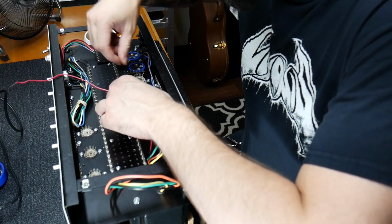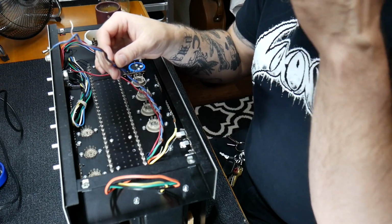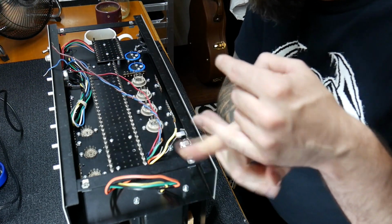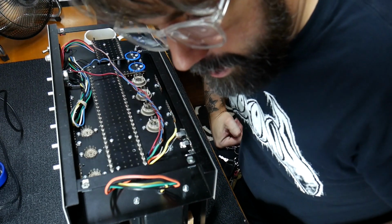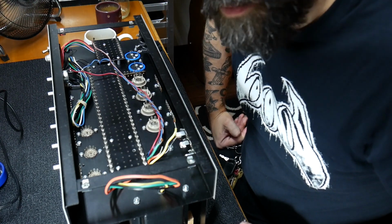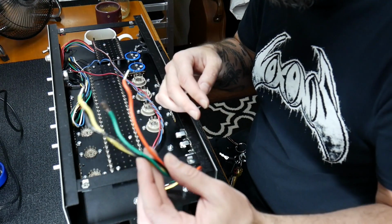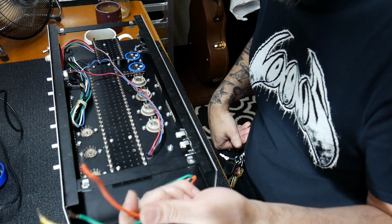Then these other 2 wires, I'm going to check my schematic again from the manufacturer to make sure, are the outsides of the output transformer primary that hook to the plates of the power tubes. And then basically what happens is it transfers the audio signal over to the secondary side of the output transformer, which then hooks to our speakers.